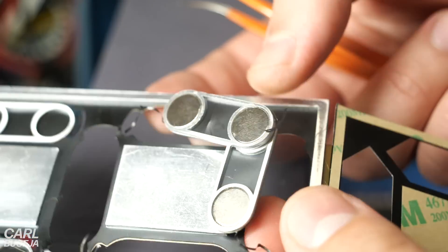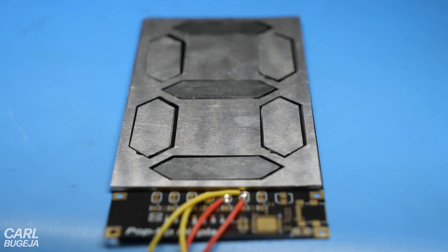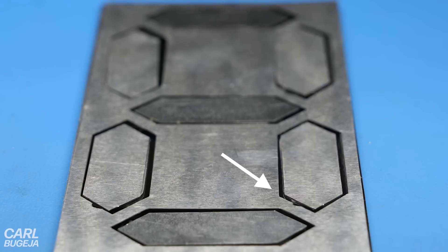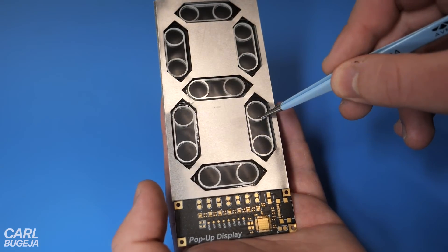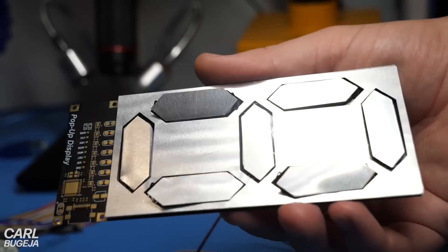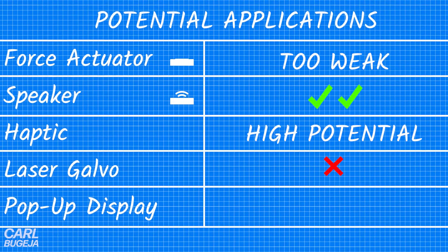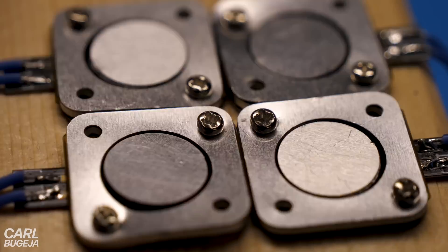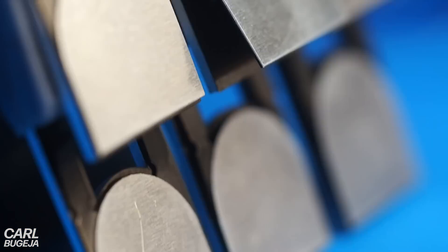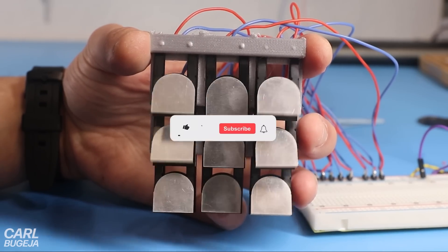I tried a new sample, this time loading just two segments with magnets, which created the number one — but the popping of the magnets was far less stable, and sometimes the arm was peeking out. This was partly my fault because I only put two zigzag arms instead of four, which also made it hard for it to stand upright. For a display application to work, four arms are definitely necessary and the magnets have to be spread out more. I think there's potential to create some kind of reflective or tactile display with these flexure actuators, though flaps may be more effective than flexures for these types of displays.